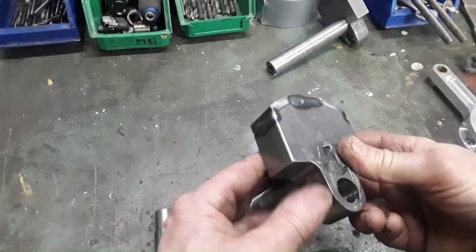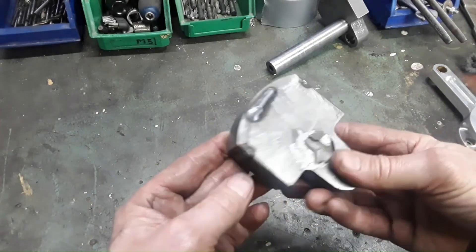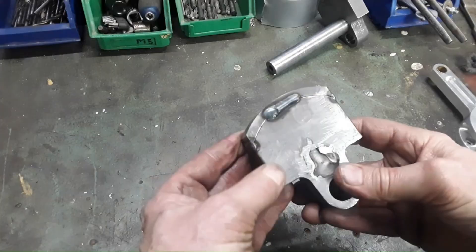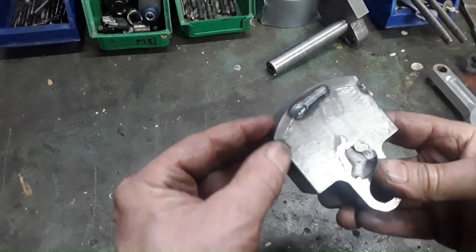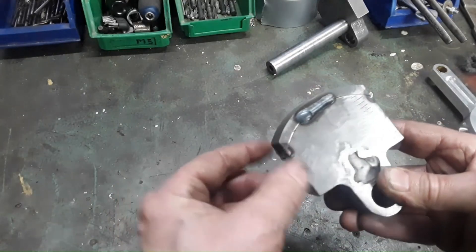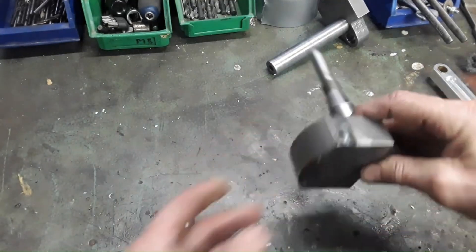As you can see, I had problems when I made this. I thought that I had a big chunk of metal here, but when I was balancing the crankshaft, it wasn't enough. So I have to add on 7 millimeters, and now I have to remove it again. Let's do this.